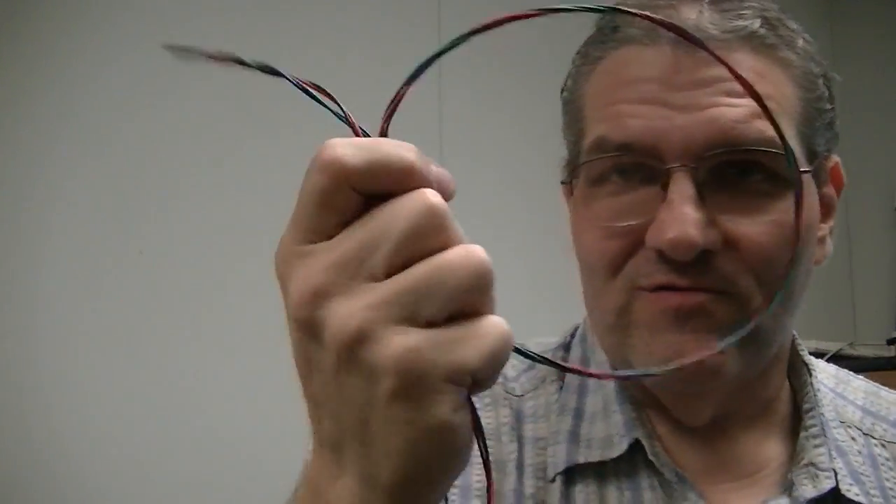That's how I do most of my multi-conductor cables that I make myself. I do this all the time — I've done it with as many as ten wires and you get a nice bundle. I don't need zip ties, I don't need anything to hold this together; it can lay on anything and it'll hold itself together. That's how I did my whole 3D printer. Next video will be a review of how I routed all these bundles around through the extruded aluminum. So until then, thank you.